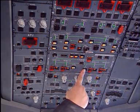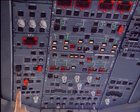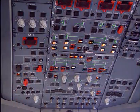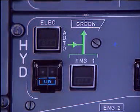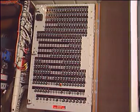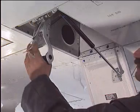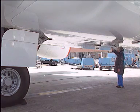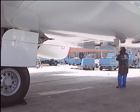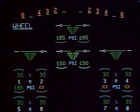In the cockpit, turn electrical external power on. The horn will be activated. Pressurize the green hydraulic system and ensure the landing gear circuit breakers are in. Then replace the ground door opening control handle in the closed position, and check that the doors are up and locked.